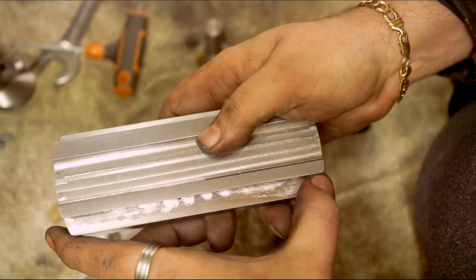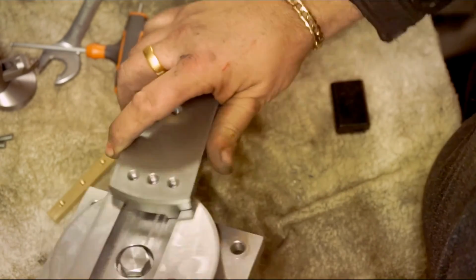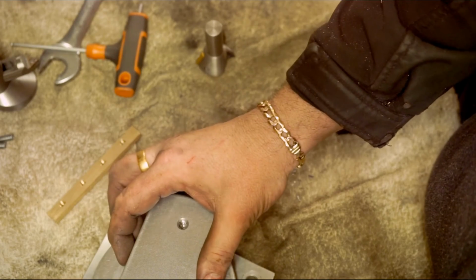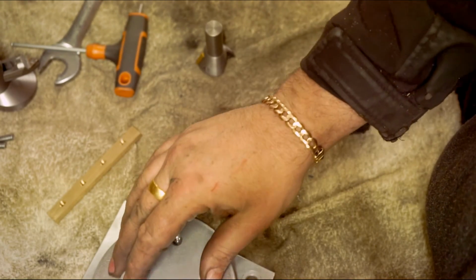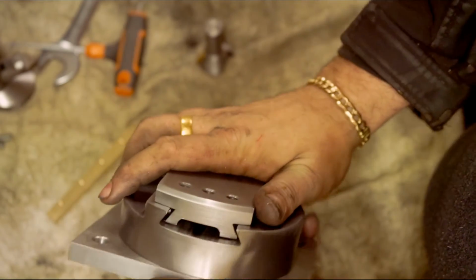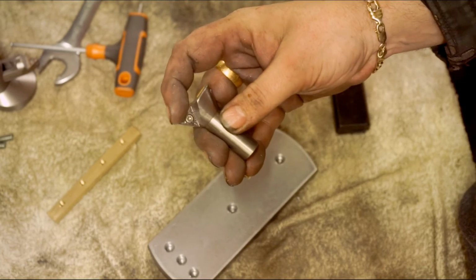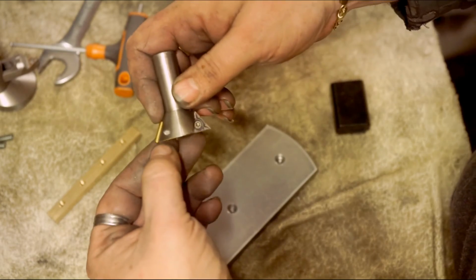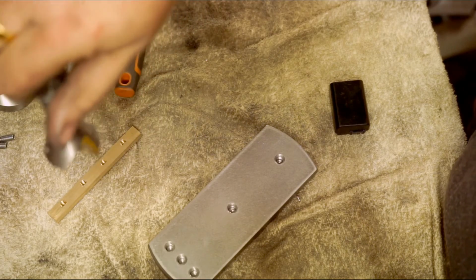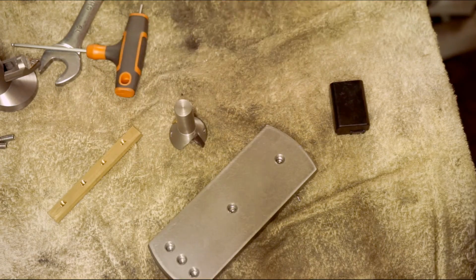You see how that's rough, there are a few chatter marks on that surface, and that's a mating surface. When that's bolted down, you'd set it and then tighten it. It's not like a lathe slide where that's going to be sliding all the time, but I still want to clean that up. That's the actual mating surface there, so you want that to be clean. So I was thinking, instead of using these triangular ones, use something like DCMT, so it's just the actual tip that's going to be like a fly cutter on the bottom surface, and then the edge of the cutter cutting the actual dovetail. But that went on a little bit longer than I thought it was going to.